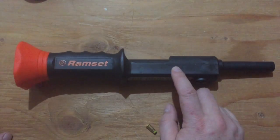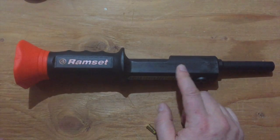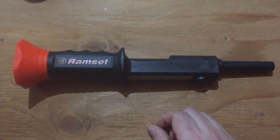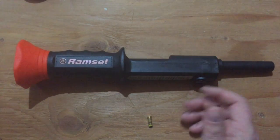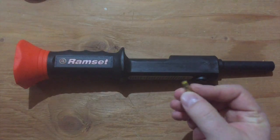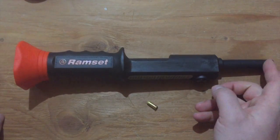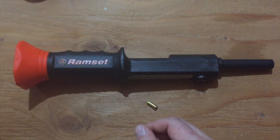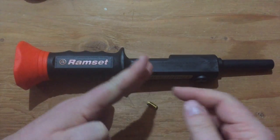This is a great choice for attaching the board to the floor. There's some debate on whether it's the best tool for attaching furring strips to the concrete block wall. For solid poured concrete it would be great. For the concrete block, most people seem to think it's fine as long as you use the mortar joints — I think it's brown that you use to fire into the mortar joints. If you actually try to fire into the concrete blocks themselves, you get spalling, which is basically you blow out on the back side as the nail goes through, leaving kind of a crater.